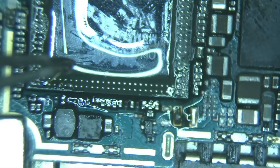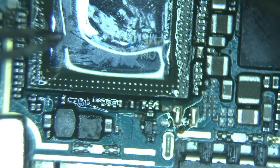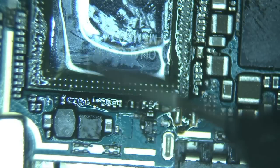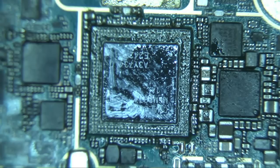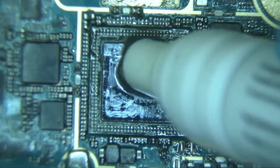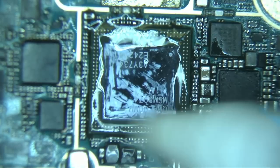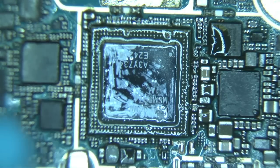By the way, if you have any questions or comments, please be sure to leave them in the comment section below and either myself or one of our team members will be happy to respond. Instead of using just alcohol, which requires a lot of scrubbing with pressure to remove the old flux, we actually like to use the no-clean liquid flux here to clean the chip.